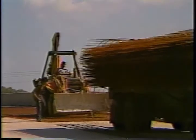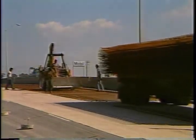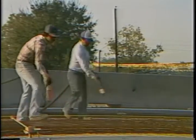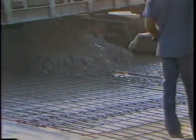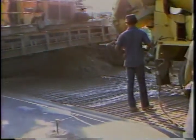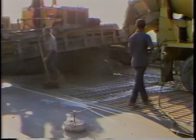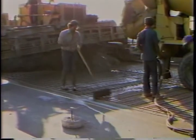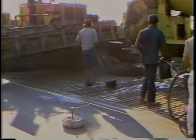Laying the steel reinforcement directly on the existing pavement saves time and money. Steel can be placed the day before placing the overlay. Air blasting gives the surface its final cleaning and is done before grouting. The pros and cons of grouting are still being investigated. Under conditions of a wet pavement surface, grouting may be imperative. However, for the Loop 610 overlay, the engineers applied grouting throughout the project. Grout is pumped onto the surface beneath the steel immediately prior to placing the overlay, as it is critical that the grout not be allowed to dry before placing the concrete overlay.